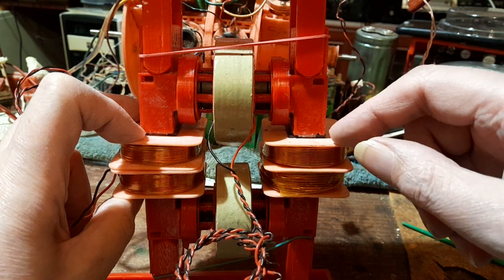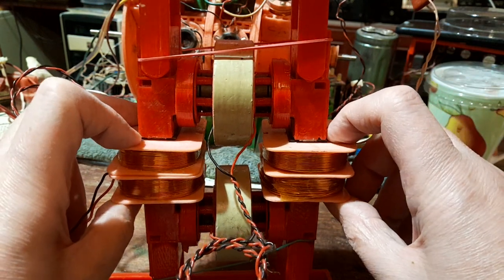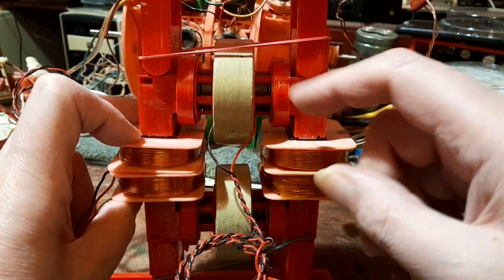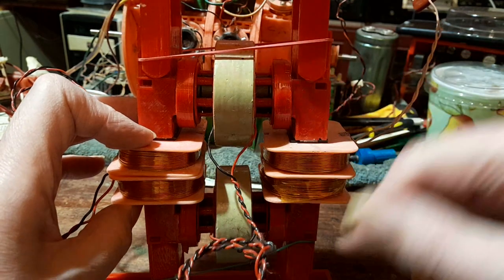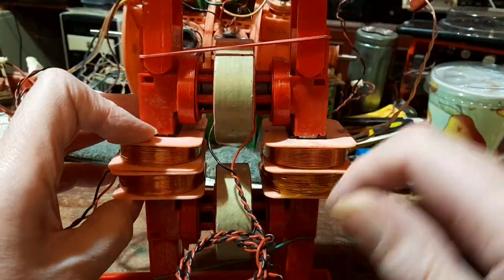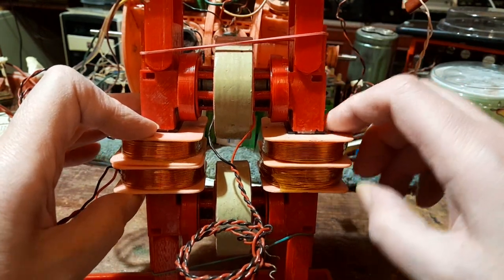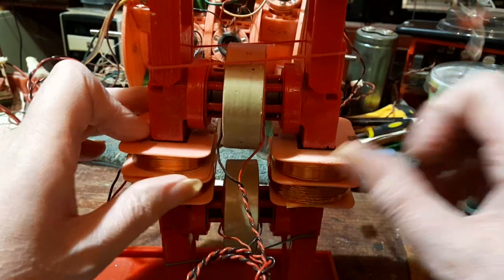It's all to do with timing — milliseconds, microseconds. I was pulsing this thing at around 1 millisecond, then 500 microseconds, and that was the only way I could get it to work. I think it would work more effectively at a lower frequency if this half was working together and the other half was working together, instead of all in series. Basically the flux goes around in circles like AC, but by pulsing it up and down we create two separate channels — one going around this way and one going around the other way. That's what I'm theorising at the moment.